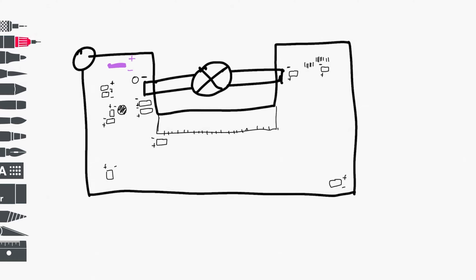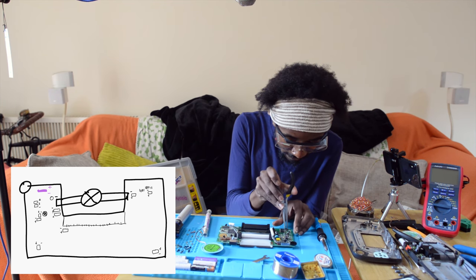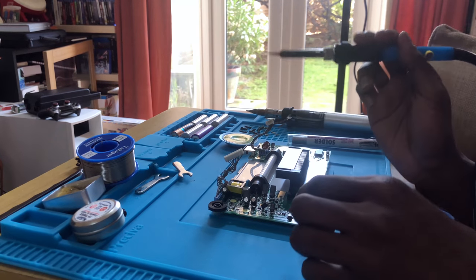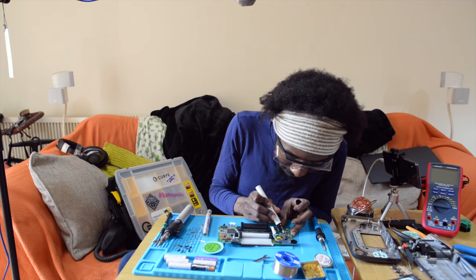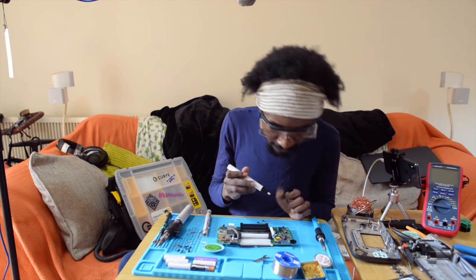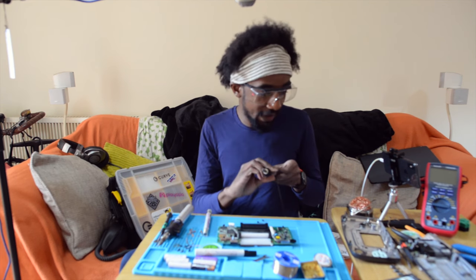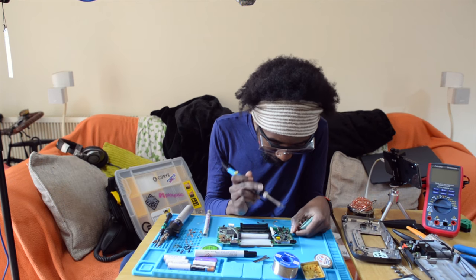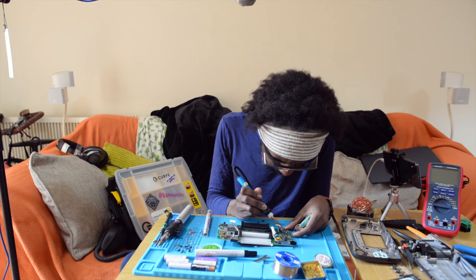There's one I missed and didn't lift up so I'll do that in a bit. That one is minus and plus, and that one is plus and minus. At least now I have a reference I can go back to. Now I need to get these components off first, which is tricky — it gets harder to desolder the worse condition the pads are in. That dusty one from the start is going to be the hardest because it might have rotted down to the pad.